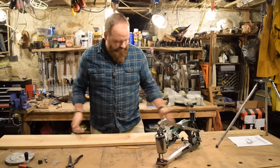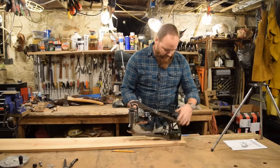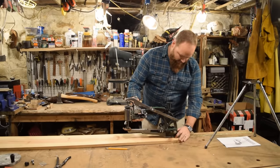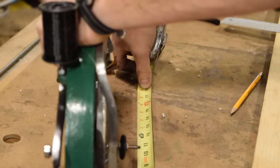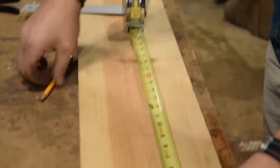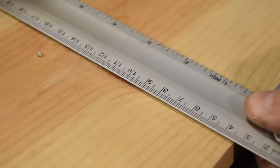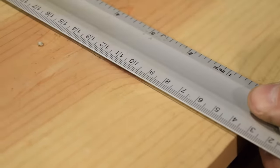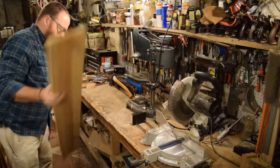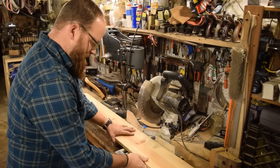Pulled out this just scrap piece of pine that I have. So I'll build the base for this. I'll probably center the arm so this is in the center, and go mostly to the back. We'll put a little piece of wood underneath just to brace the middle, and then trim it to the length. It should be pretty easy. And I have the bolts that are in the stand, so I'll use those to attach this to the base.